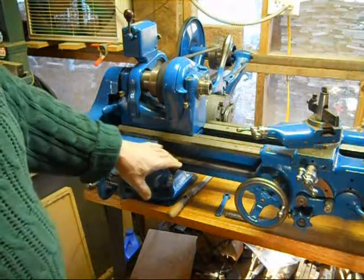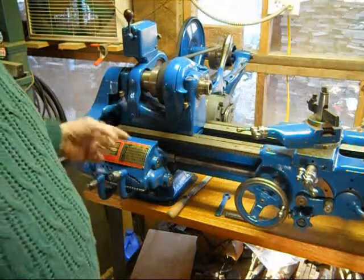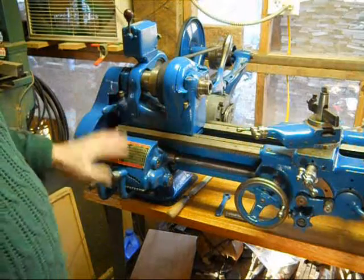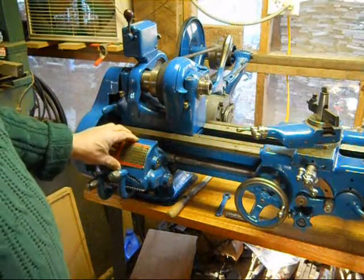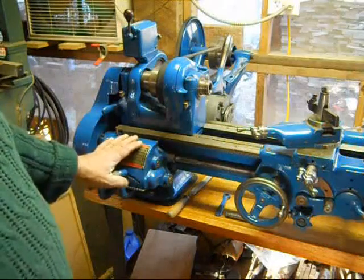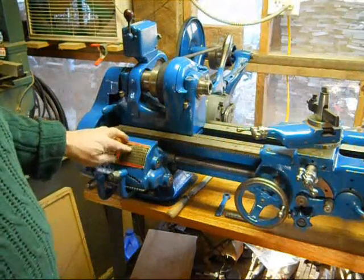Backwards, of course, because coming from the machine side, it's like a transmission, you know, and the engine side puts on more stress than the outfeed side. So going backwards, I could turn it by hand. I couldn't turn it by hand on the feed side. So I decided to put it back on here. It runs really good in every position. It's nice and quiet. I'm happy with it, and I'm not worried about that 18-tooth gear is what I'm trying to say.